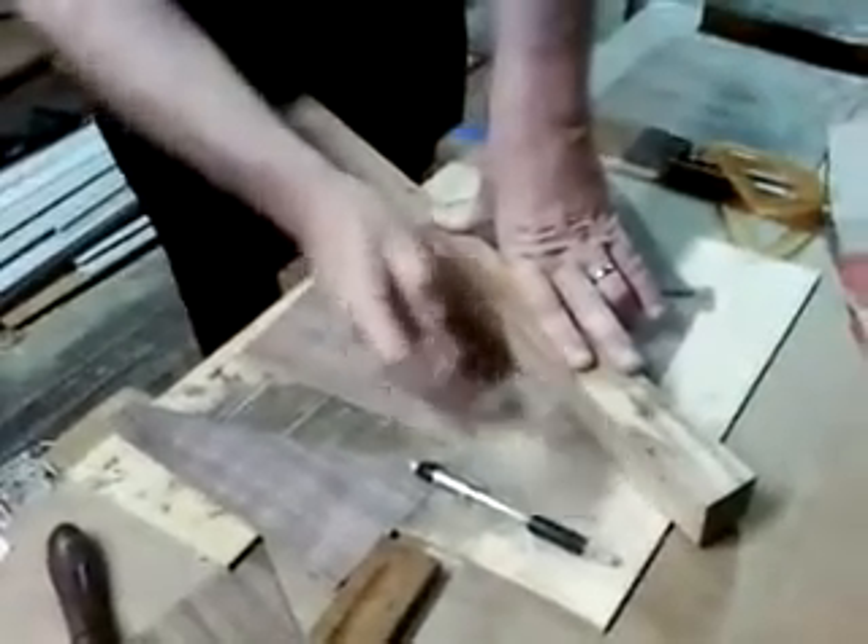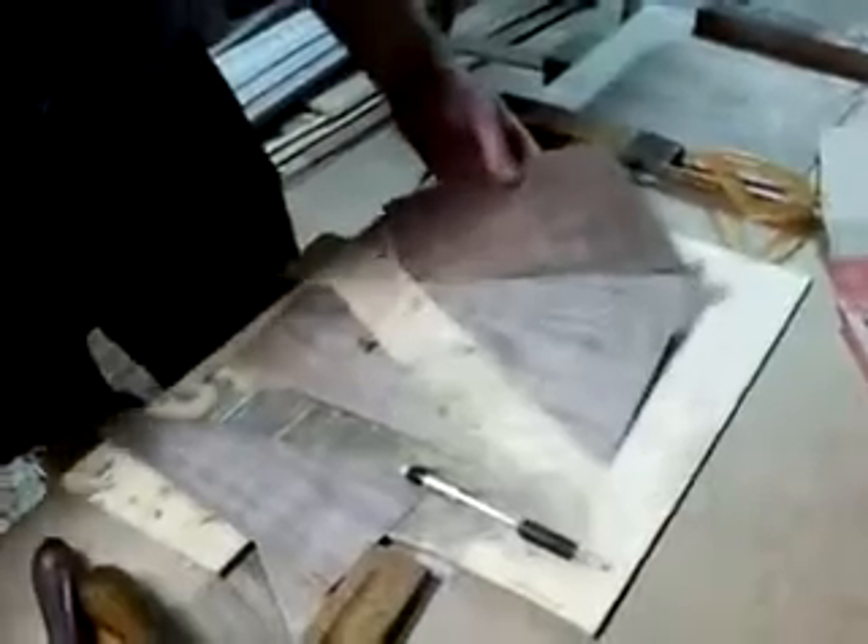Sometimes I'll make small adjustments to get a nice, perfectly straight cut. The next step is to take the third sheet and do the same thing — knock it down in the middle, line up the center line, set it to 22 and a half degrees, and cut it off.